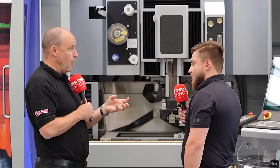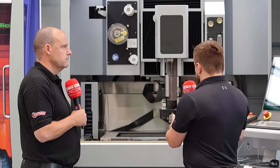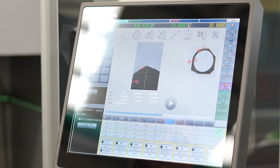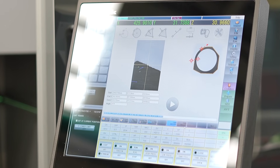The application being demonstrated here is particularly pertinent — it's really the high end of what you're going to be wire eroding. It's a profile with a two-micron profile tolerance, and this is actually a metrology gauge for splines. It's going to be used for checking splines once they've been machined — a go or no-go gauge — and the result determines whether the spline is correct.